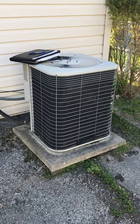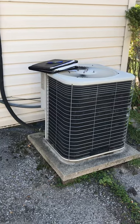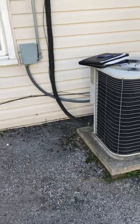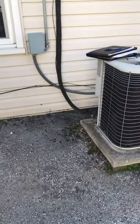So if we're looking at the house from the street, we've got the condensing unit on the back side — it'll be closer to the left back. We've got the line set; the house is on a slab, so the line set's running up and through the attic space. It looks like it's sized right: three-eighths by three-quarter.